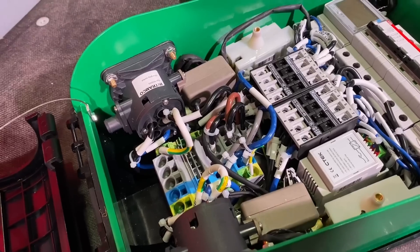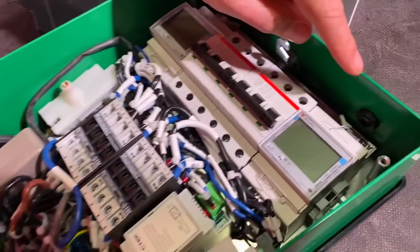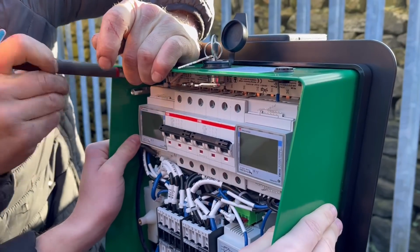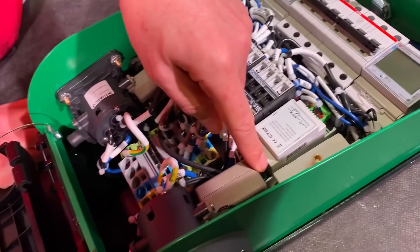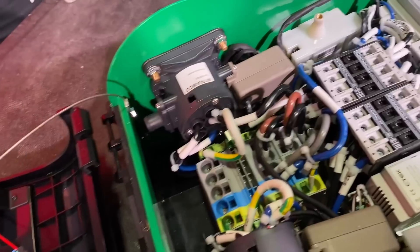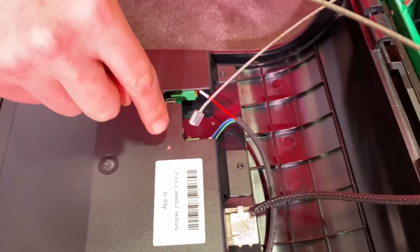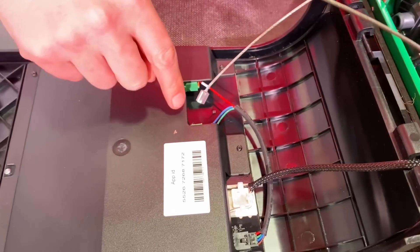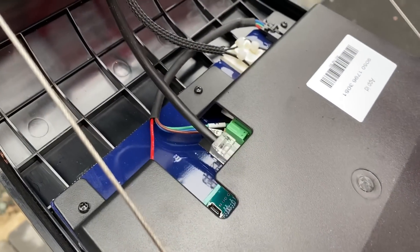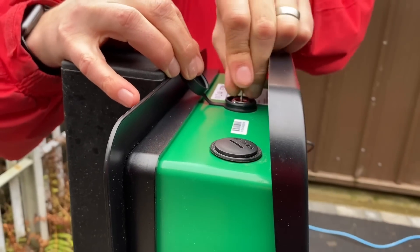Before we leave this, let's look at the mounting points. There are four mounting positions visible through the back of the unit - two at the top and another two midway through the unit, just behind the solenoid at each side. Coming down to the front cover, for data connections we route our ethernet connection to this RJ45 port here, and we've also got a mini USB connection that we'll use for some initial commissioning.